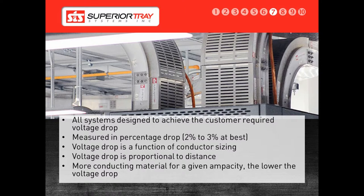The first is the skin effect of the conductors, which changes how electricity moves through the conductors. The second is the proximity effect of the conductors around it. The reactance of the system can be changed due to magnetic fields and eddy currents that impact the surrounding conductors based on the arrangement of the cables. As a result, balancing and cable arrangement have a large effect on the voltage drop of a power distribution system. The volt drop on a cable bus is much lower than the voltage drop on a cable tray application, as the conductors are arranged in a specific order within a Superior Bus.